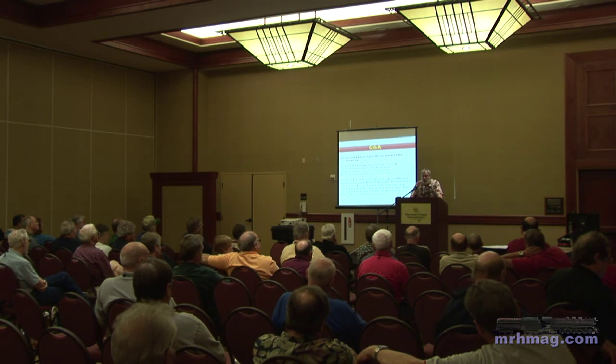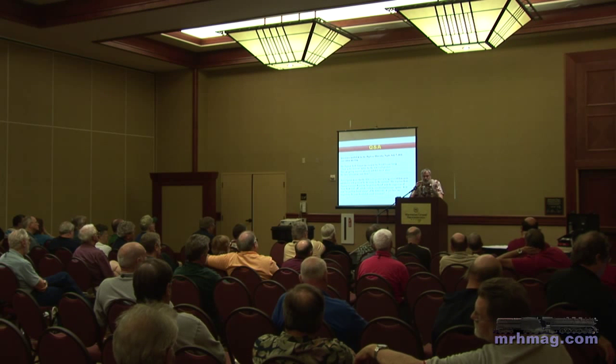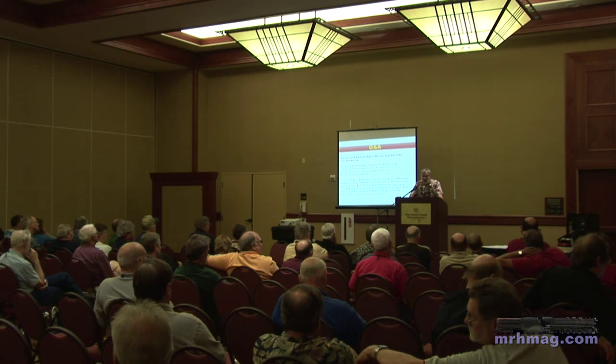The resonator cavity must be larger — it gets into physics. The mounting of the speaker is the most critical item in any installation. When we first found the back EMF issue, we put in our factory notes — going back a year or more — that if you have that issue and setting back EMF to zero removes the problem, then we know that is the issue.